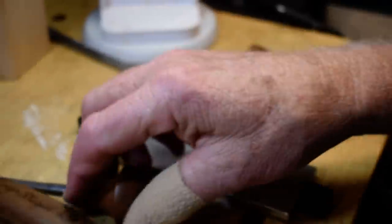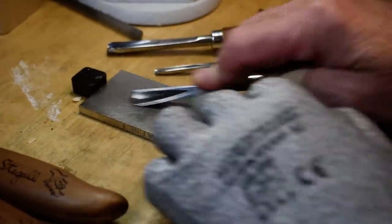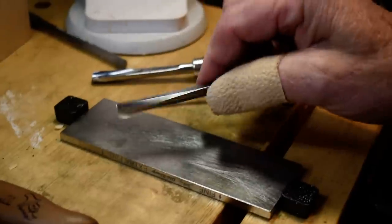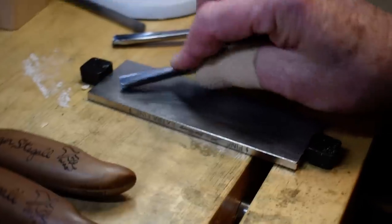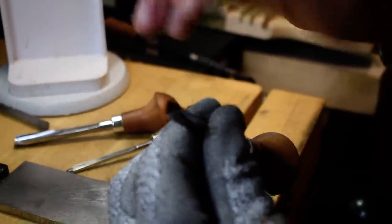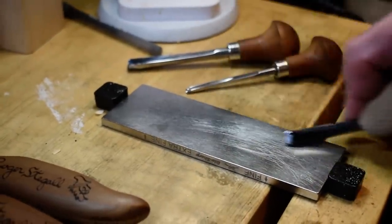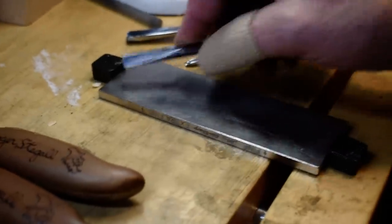Back to sharpening my tools — here's my V-tool. What I do is sharpen the flat side of each side. I couldn't tell you what degree bevel I'm at, but it's a really shallow bevel. On a V-tool there really is a little small gouge or U-shape on the inside, so you want to kind of roll this like this. This is the extra fine stone, and this is what I do to maintain my tools.